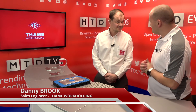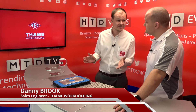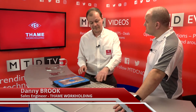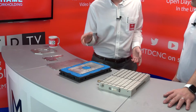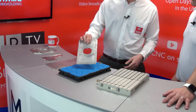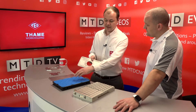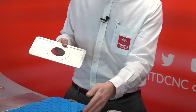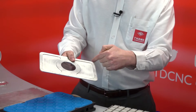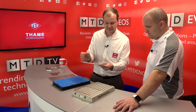The vacuum systems that we sell work off a designated pump outside the machine. You have a pipe that comes into the machine and connects to one of our various fixtures. The main one we offer is called the vac mat, and the main benefit is that you can actually machine right the way through the component and into the fixture without damaging the aluminium or steel. You can also go all the way around the profile, so you're getting parts off that are completely finished — there's no sort of snap out.